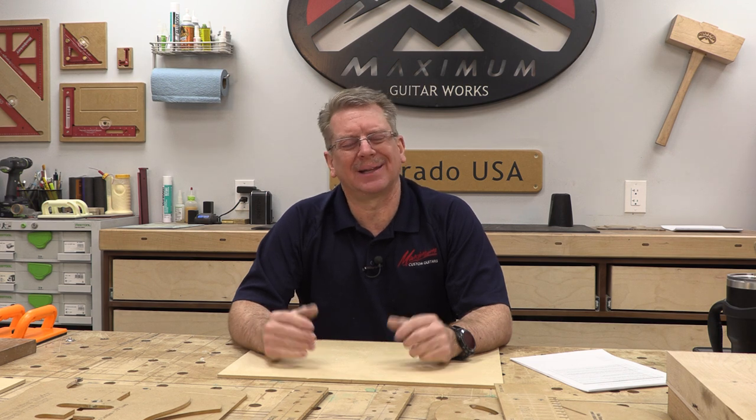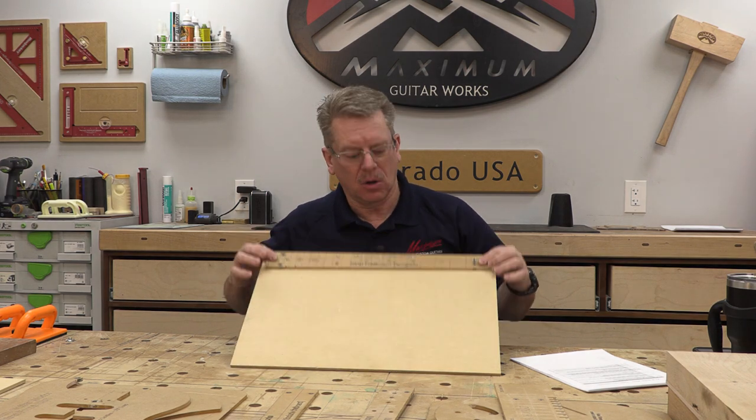There was a lot of damage happening to those acrylic templates, which was frustrating. Acrylic templates can be repaired — I use automotive Bondo, which cures quickly, gets hard, and is very sandable, easier to sand than acrylic. It's easy to fix and patch nicks from a router bit. But there was a lot of repair, so I morphed it: students take my templates and make their own copies from them. It's a safer operation — just flush cut it — and they have a replica they can take home.